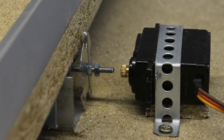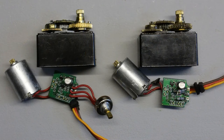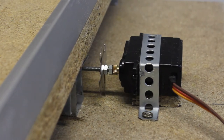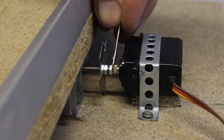The axes are driven by standard servos having metal gears and ball bearings. Two of the servos have to be modified for continuous rotation. First, the stopper on the gear at the output shaft has to be ground. After that, the potentiometer has to be removed and replaced by a voltage divider composed of two constant resistors. The advantage of this type of servo is the 3mm thread at the output shaft, so the threaded bar for the drive can be mounted easily on the output shaft — use a nut to fix the drive.